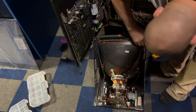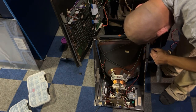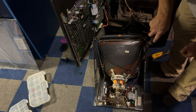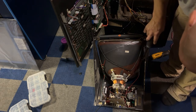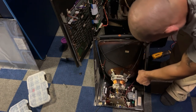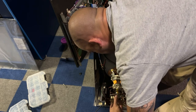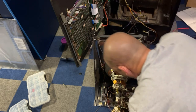Let's wrap it around this bolt. Nope, around here. Yep. There's our big spark. I heard a second spark. Let's pull this back and look. Okay. All right, we are discharged. Now we can unscrew this chassis from the tube or the frame. We gotta change this frame out anyway, so let's get this chassis off and then I'll do that later.